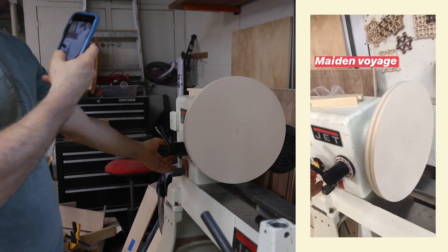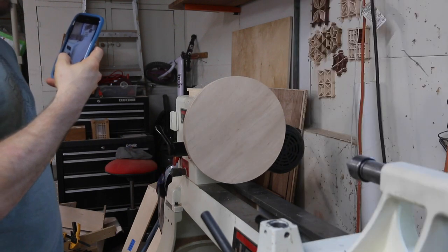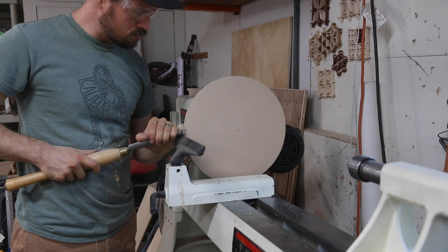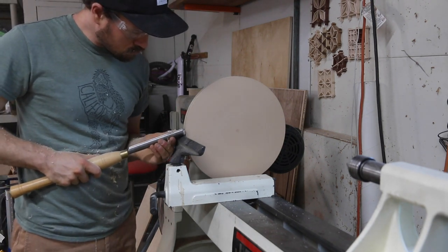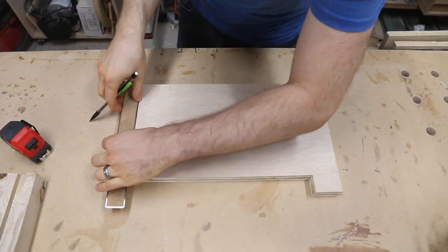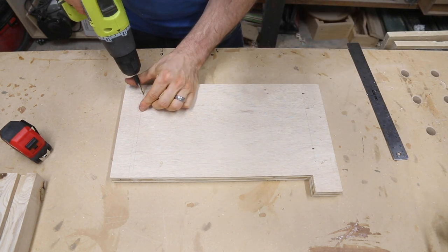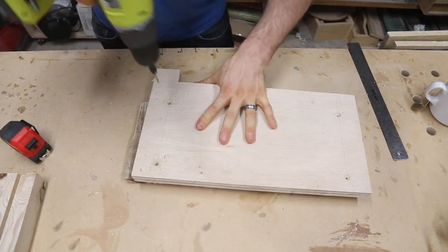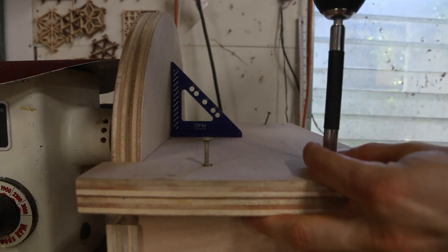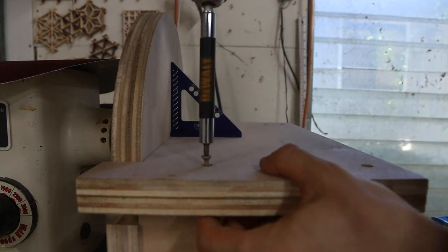And I had to do a quick test drive. The edges were a bit out of round, probably due to the nail I used before, so a quick touch up with a roughing gouge was necessary. The face was really flat though, and didn't require any touch up. Once the disc was completely round, I double checked the fit of the box — no issues. The last step of assembly was to attach the table. Using blue tape as a shim and a walnut wedge, I mounted the table to the box completely square to the disc. I secured it with four screws. And this wouldn't be a Bike City project without at least one screw up — so here's six holes for four screws.